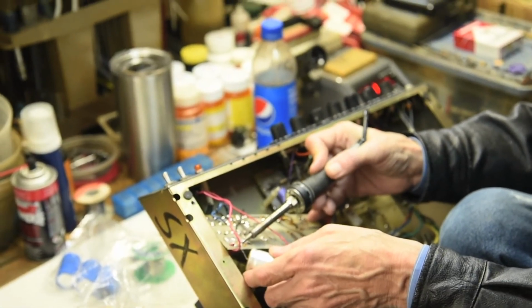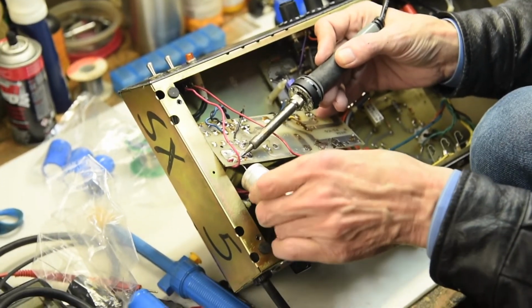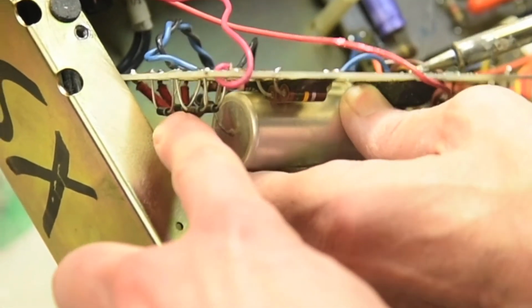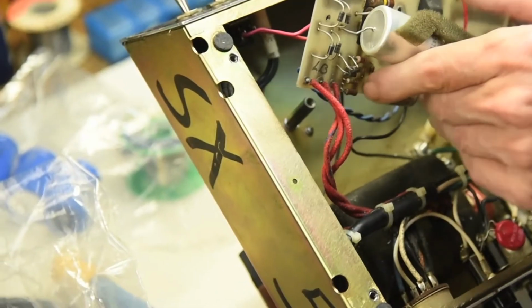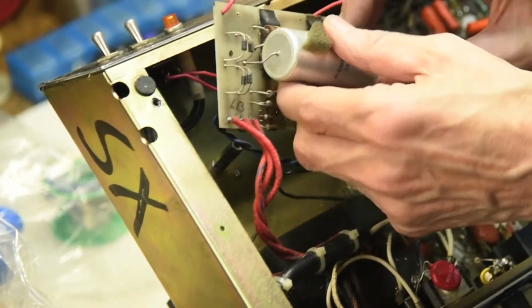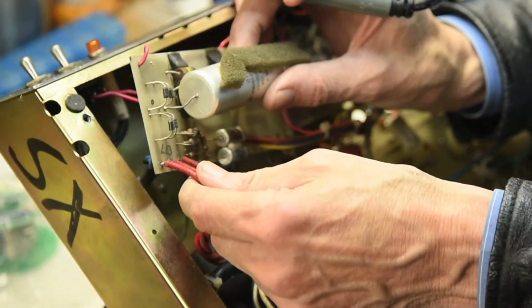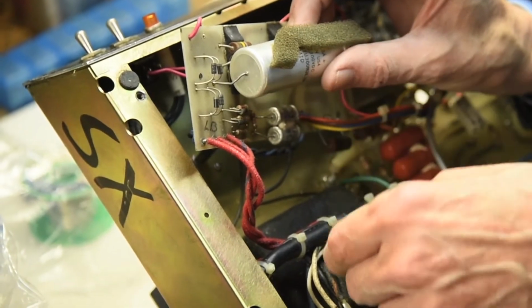That's just a silver cap, huh? Yeah. I don't really want to take a guess on what that is, but that's your diodes. That's what I was going to say, actually. That's what turns this AC into DC. Oh, so rather than a rectifier section, we've got these diodes right here? This is the output section, the 450 volts. It goes straight to these diodes, which turn it into DC instead of AC.